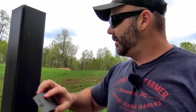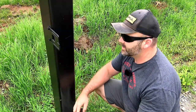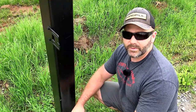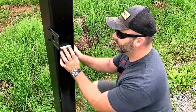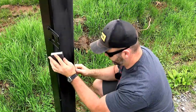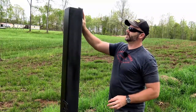What I'm going to do is sand up my post, just get it rough, and then hit it with a little bit of self-etching primer on anything that's raw metal, and then go over it with some high-quality black spray paint. Now some spots on here are really dirty, and that's the main reason for sanding — I just want to clean it up good enough that the paint will stick. I know I'll have to resurface and repaint it probably every two, three, maybe four years whenever the paint starts to flake off. This is a six-inch piece of square steel tubing set five feet in the ground — it'd take a bulldozer to get this thing out. Take a little pride in your work, do a good job, and it'll last you.